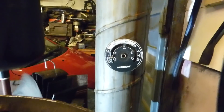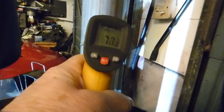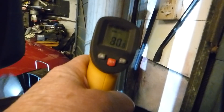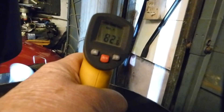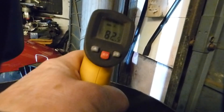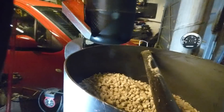Those gauges aren't very accurate, so let's have a quick look so you can see for yourself. The temperature is around 78, 79, 80 — there we are, 82°C. It's supposed to be 12 inches away when you measure. But there's no way that's going to give any gas off at that temperature — the chimney is not that hot, contrary to what people think.